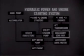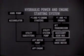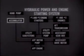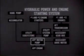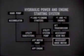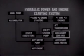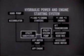Let's review the hydraulic power and engine starting system. To provide hydraulic and electrical power, the accessory gearbox must operate. This can be accomplished in two ways. Stored hydraulic pressure in the accumulator can be used to drive the APP motor pump. Acting as a motor, it starts the APP engine. Now, the APP motor pump functions as a pump to drive the accessory drive motor, which operates the accessory gearbox. With the accessory gearbox functioning, all of the utility subsystems, as well as the flight control hydraulic system and electrical system, can be operated for ground checks or maintenance.